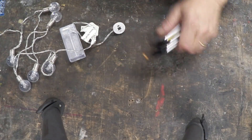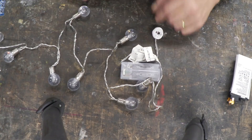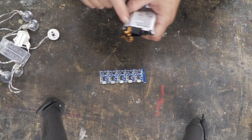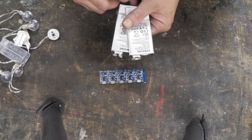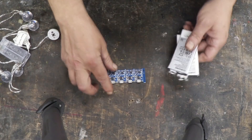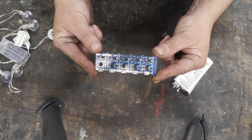To do this, obviously, what you need are some old phone batteries, whatever it is that you're going to modify, and then one of these. With the phone batteries, what we do is take off the original board and expose the tabs to the battery, just like in video 1272. So we've got our bare battery here with no control on it at all. We need to put that control back on. To do that, you'd use one of these — this is a charge board.